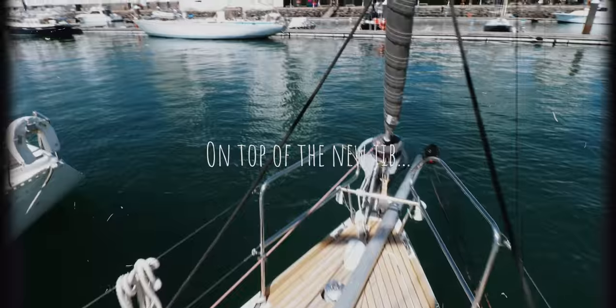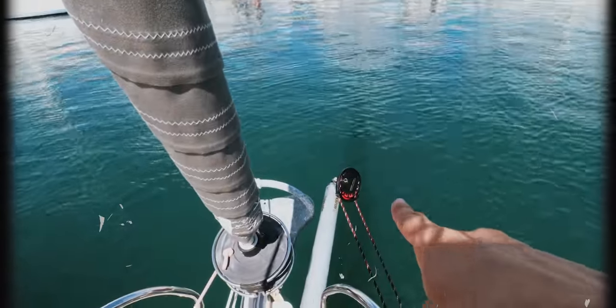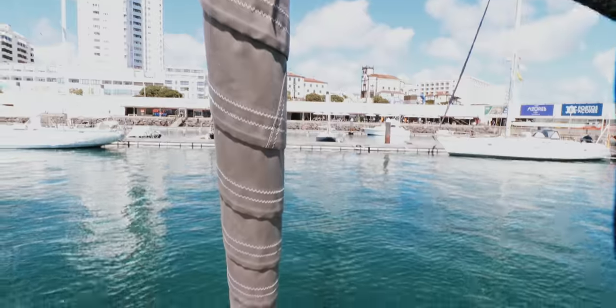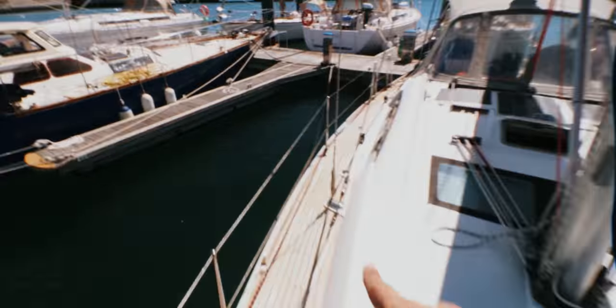The top-down furler is gonna go on this furler here, which will connect to an anti-torsion line that will go to the top. We need to rig the sail using some Dyneema to the bottom and to the top along with the anti-torsion line. And then we also need to make a continuous line. So that's my job right now.